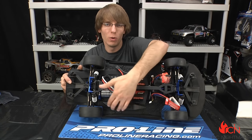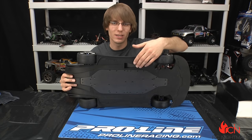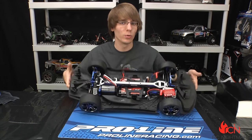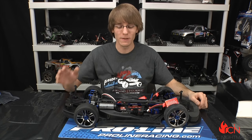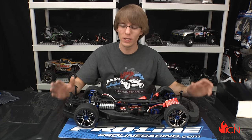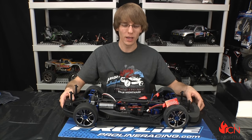There's a giant NACA cooling duct for the motor here. You can see on the bottom the special intake duct is designed to suck air in and blow it right over the motor. Without that, the motor would overheat at those speeds. As we've seen in reports, if you're overheating you actually have to increase your speed to increase airflow and cool the motor down — it's all designed to do 50-plus, not anything under.